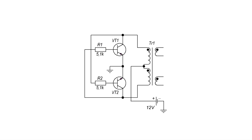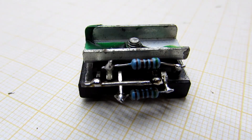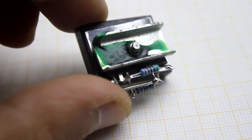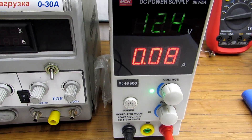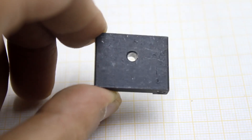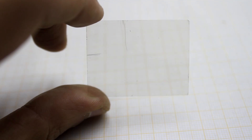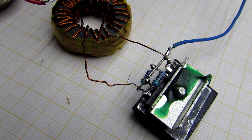In the master oscillator, transistors of NPN structure BD139 are used. The generator is so simple that I decided not to make a PCB. The current consumption of the generator is from 50 to 80 mA. The transistors don't overheat, but anyway they are installed on a heatsink, insulated from the radiator by a mica gasket. Limiting resistors at the base circuit can be from 4.7 to 6.8 kOhm.